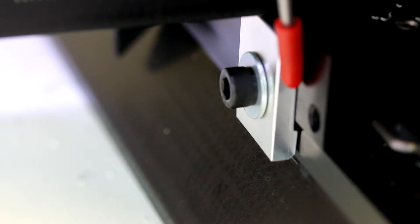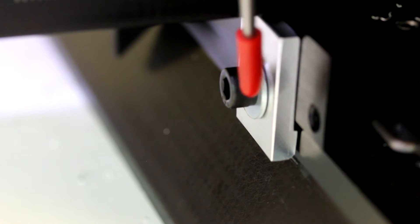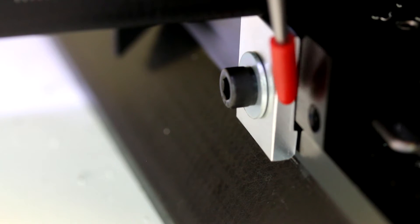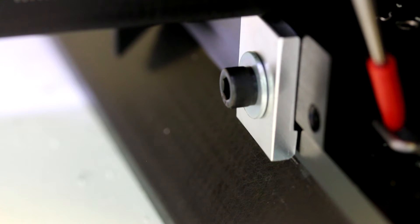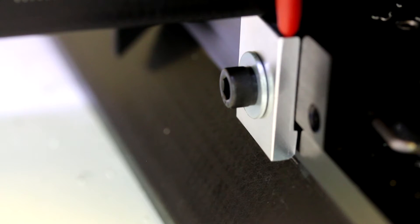The overall purpose of the piece is to provide a y-axis lock to replace the factory y-axis lock. We use the exact same hole and threads that the factory lock uses, but we've removed the thumb screw which by default presses on a tapered nylon plug inside the screw hole, which then presses against our gib. That's supposed to pull the dovetail tight and lock the axis, but since we've lubricated these surfaces, it's not a very functional method of locking them down.